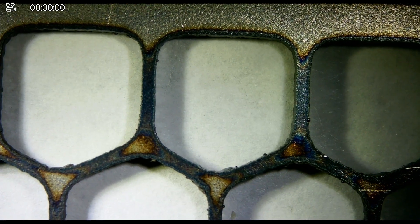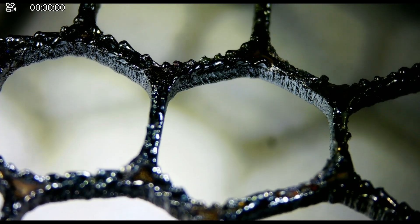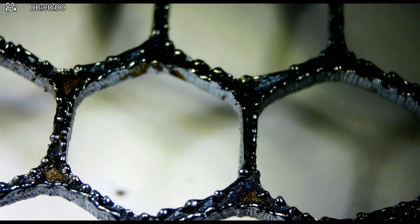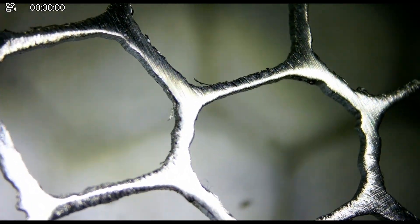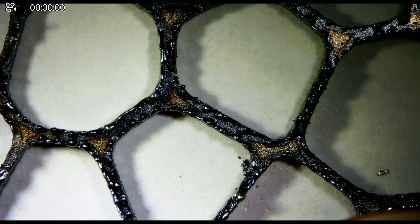What you probably haven't seen is what the back looks like. I'm running 125 PSI compressed air. So this is what the dross looks like on the back. You could take this off with a flap disc and clean it up. This one over here is cleaned up on the back side — I shot it with a flap disc and then took it to a 3M wheel on a grinder. But if you didn't take off the dross it looked like this, and actually it looks kind of cool — an interesting pattern as it is.